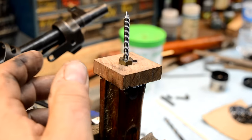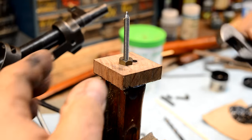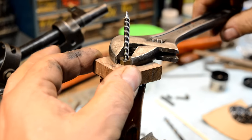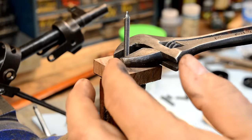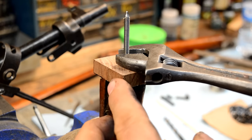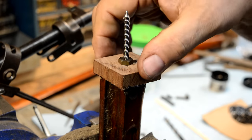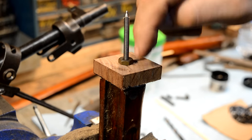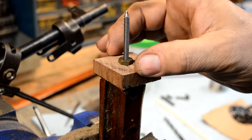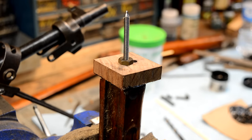Now this nut's gonna come back off. That's not gonna live here. But what this nut's doing is pulling up on this rod, which means it's pulling down on this seal, and I'm getting a little bit of squeeze out right around the edges here. And that nut will make damn sure that no matter what happens, this thing sits down tight, and then the glue that was on the rod around it will also capture it. We will then come back, pop this nut back off again.